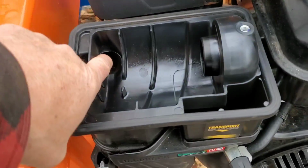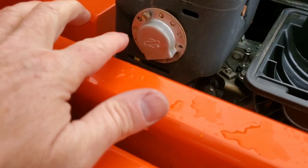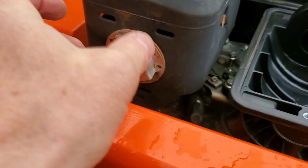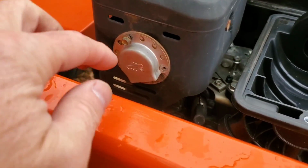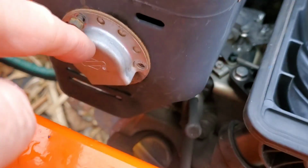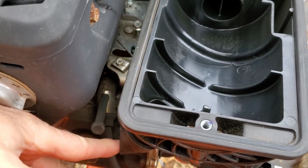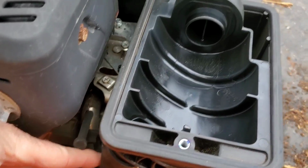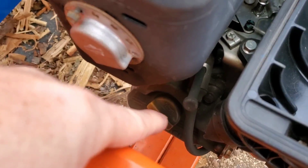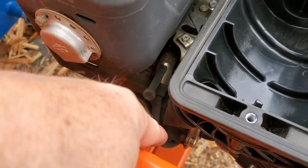I see the main inlet here, and I come around to this side. And I notice that the exhaust deflector, which you can turn any direction that you want, I have it just tacked on right now just to show you for effect. It's blowing the exhaust right onto the air inlet to the air filter for the carburetor. On top of that, it has scorched the oil inlet and the spark plug wire, right?